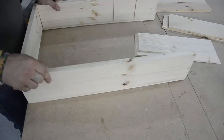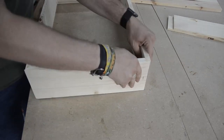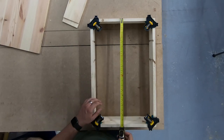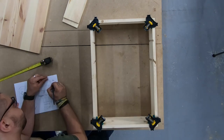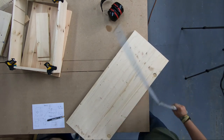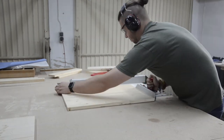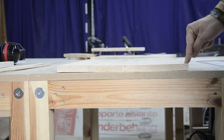For the door, I first had to put the box together and measure it. By cutting the side parts to length at the beginning, the dimensions have shifted somewhat. This piece offered just enough space to cut the door out of it. But the plate was not flat. It was also way too big for my jointer, so I had to use my hand planer.